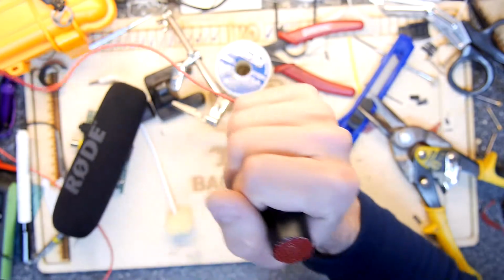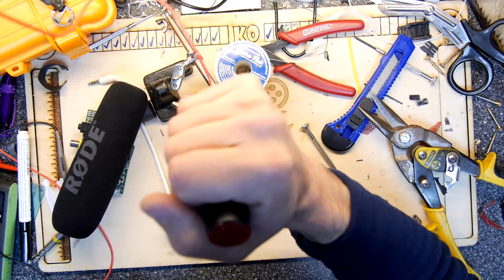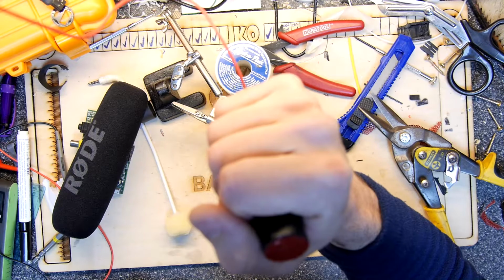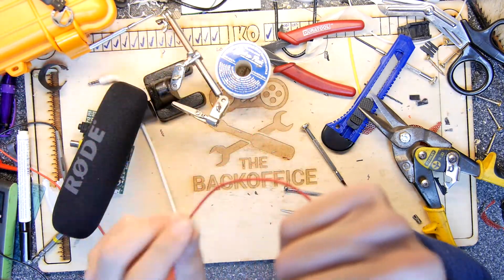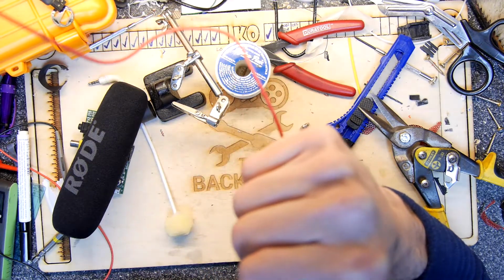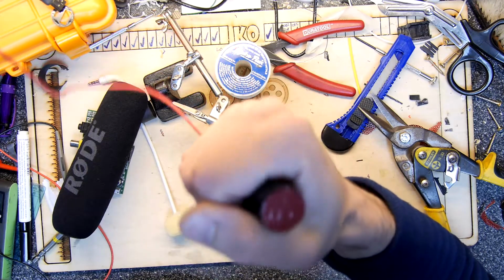And I don't really quite know what it sounds like because I don't have my headphones on, and I should have. I think I've actually isolated the source of the hum in the back office, by the way. It is the power supply supplying the Rushes monitor, because this red wire acted as an antenna. It's really picking it up coming from the camera, so I'm going to have to sort that out. But that's good. At least we've got rid of that hum. So hopefully in the future now my videos should be much clearer. So there you have it.